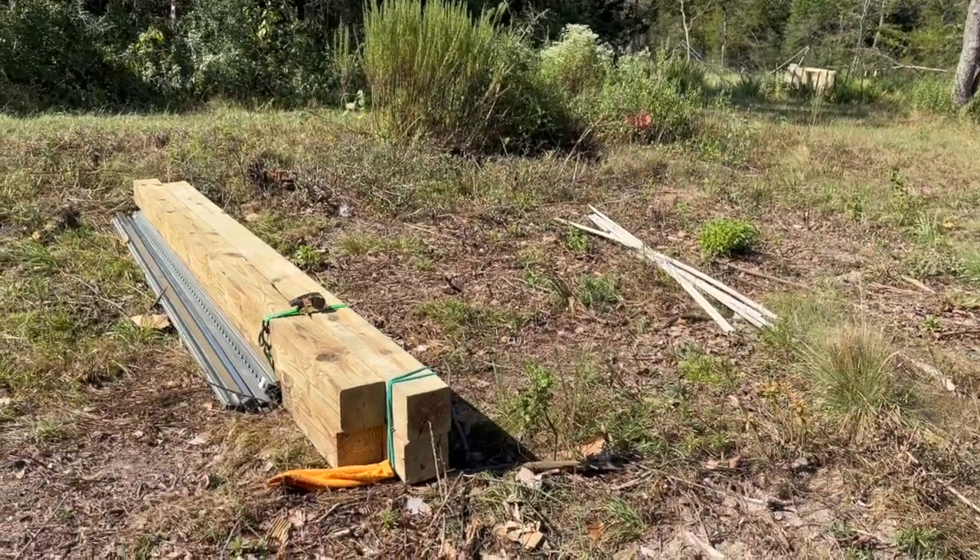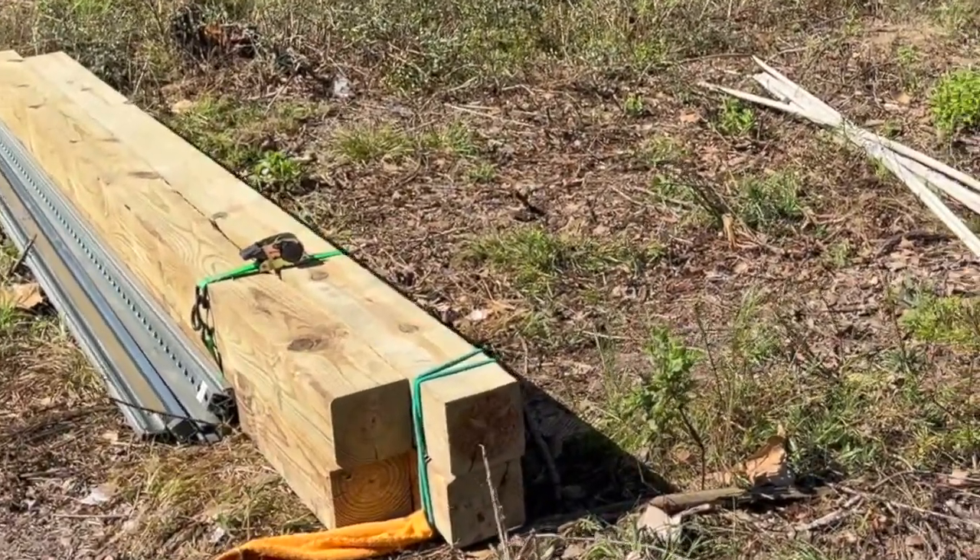Kudos to Average Joe and a couple of other solar YouTubers who mounted their bright mount kit directly on the tops of posts. After running the numbers, I felt this method was the best value and most secure for the dollar. I finally chose treated 6x6 posts and purchased them at Lowe's or Home Depot because both carry them. Get a strong friend for help because they're heavy.